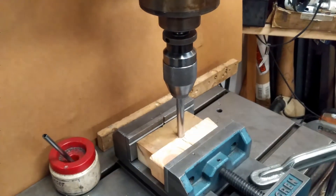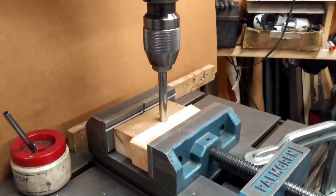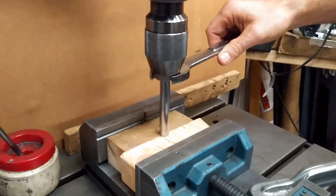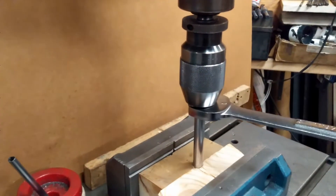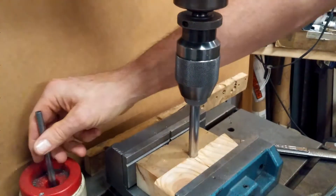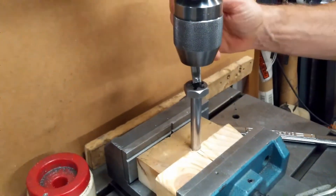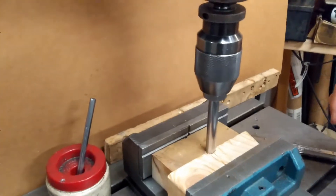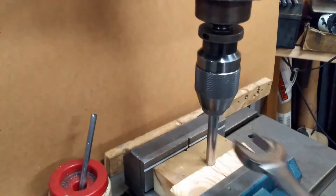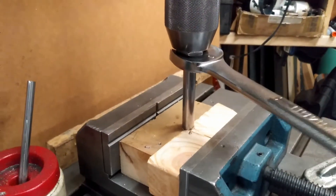So we want this to start dead straight, and the way to do that is to use the end of the drill press to hold that nice and square, put a wrench on it, and push down on the drill press — but not super hard — as we start to turn it. I can feel it starting to cut — that's good. We pull it up a little bit, put a little bit of tap magic fluid on there, then continue turning. We can start to see some chips coming off. Because this is stainless steel, chip breaking is really important.